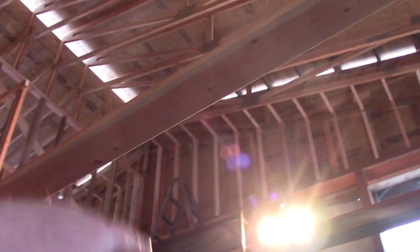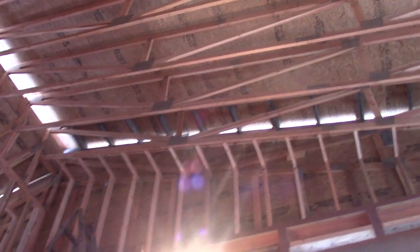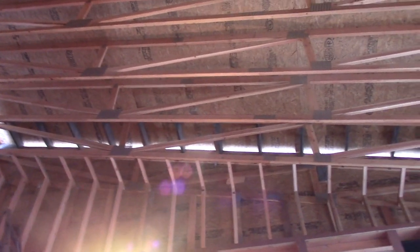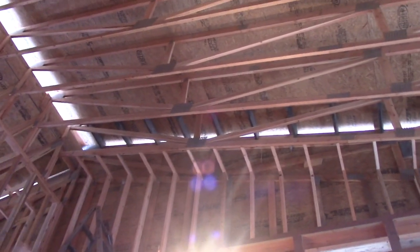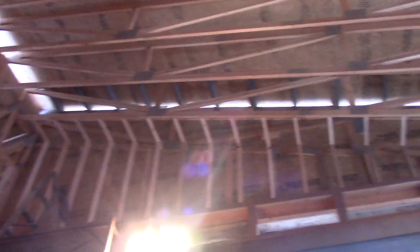Enough whining — we got that end all done. The whole peak — the little pointy part at the end of the wall — we got that all insulated up. Now it's time to do this one, and I've come across this whole wall tying everything together again. These are the walls that are going to get hit frequently with heavy winds, so I'm going to tie them better. I've got some plates, and basically if those trusses want to lift, they're going to have to tear the whole top of the wall apart.